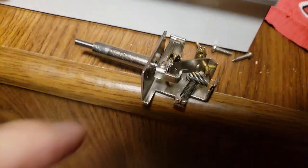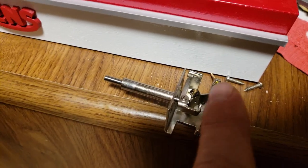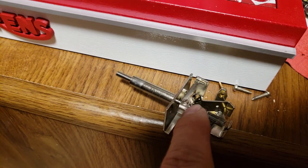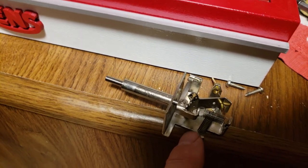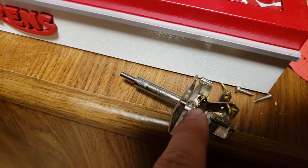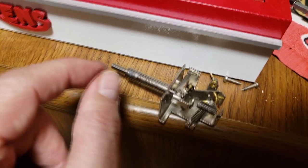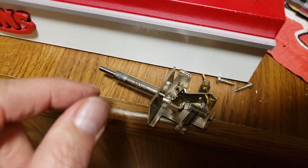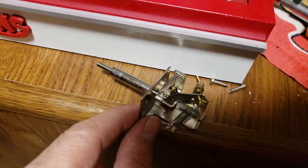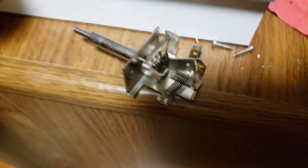Okay, I'm not going to lie to you. It was a little bit tricky to get that screw back in because to get it lined up, you had two springs acting on that post — one that's attached to this lever here, which rests on the bottom of that post, and the other spring, the bottom spring. And then this spring, which actually attaches to this armature that pivots around the screw here. So what I ended up doing is disconnecting the spring — just use a set of tweezers — and then I was able to fiddle that screw back in and get it screwed in, all the while holding that lever back. It took a little bit of coaxing, but I got her all together. And as you can see, I've even got the little barrel in on that plate that acts on the plate.